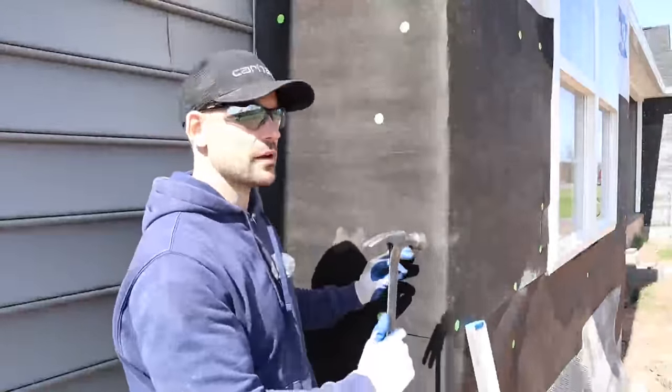As you can see I've got all the underlayment and metal lath on, and as you'll notice I've got the window wrapped up in plastic so that any scratch coat mortar does not get on the window. I also have one more thing to do before we apply the scratch coat: we need to install the brackets to hold the accessories, like this light trim and this under-seal. The under-seal is meant to go under a transition from siding to the foundation or underneath windows.